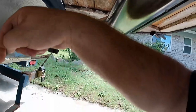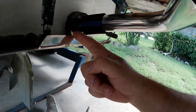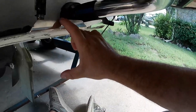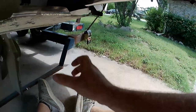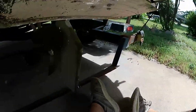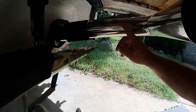This arcs down. This is in its highest position. We're going to use this to find the middle line of the boat, but this thing basically just goes down and up probably about that much right here. So as long as we keep this out of the way, we're gonna have our down tube come down here and meet the kind of center line of the prop, approximately about 2 inches above the center line of the prop down here. So right now I got to figure out this depth and cut these angles down.